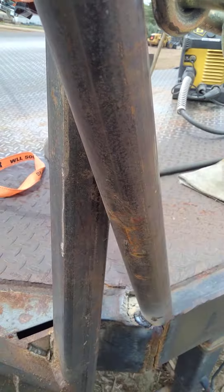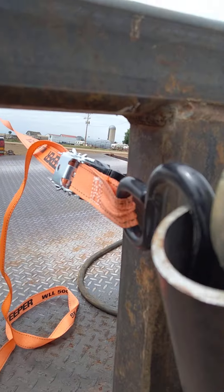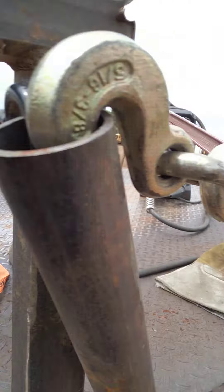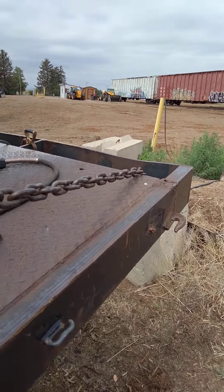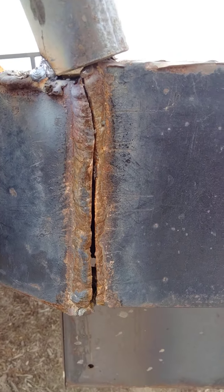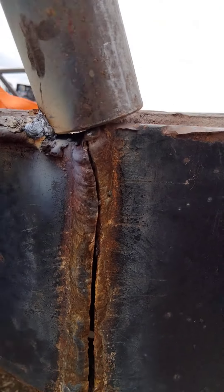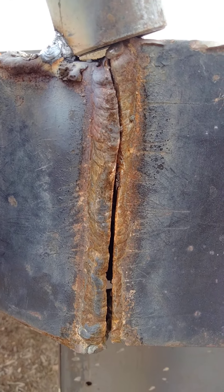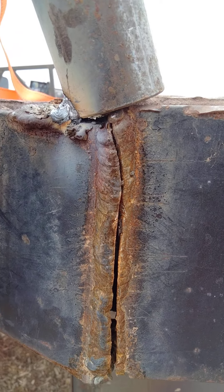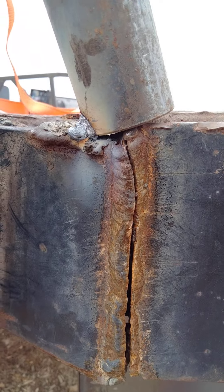It was pulling my tube to the side rather than straight back, so I threw a little extra cheater strap to help hold it over there, moved my chain hoist. I've already come up about half of that now. Weld on the pipe, don't break — we're getting pretty close. We can get it to come up; yeah, it's still coming up. We can get it to come up another quarter inch without popping and we'll be lined back up.